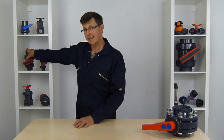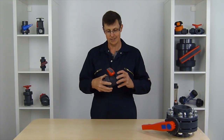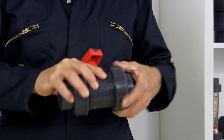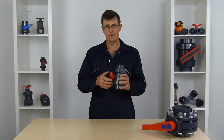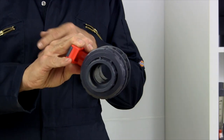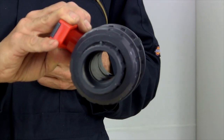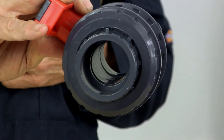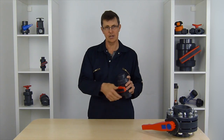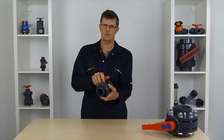The most basic type of valve you get is a double union ball valve. A double union ball valve, as its name suggests, has a union either side of the valve, so the valve can be taken out of service and put back in fairly easily. It operates on a full bore flow, so there's nothing to block the valve at all — if you get any debris coming down it'll just go straight through. It's not very good at control because it's only got a quarter turn from completely open to completely shut, so it's quite hard to control.